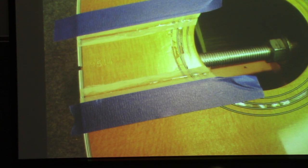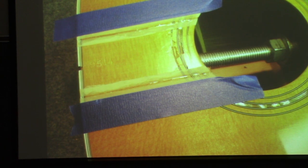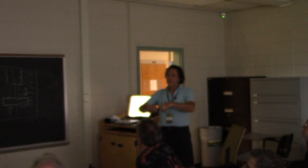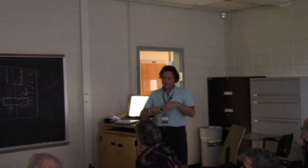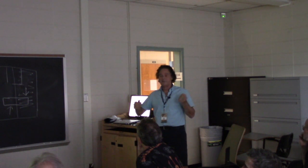How do you get the epoxy to go in? Okay. So that's actually the easy part. I mix up about 1.5 grams of epoxy. I've got a very delicate scale so that I can mix just small amounts. I usually mix about 1.25 grams resin to 0.25 grams hardener. I have it in a little 1-ounce cup, and I bring that over to my glue pot, which is about 150 degrees. I just hold the cup in the pot and stir it. If you do that in the pot, first off, the viscosity will turn to water. And secondly, you won't get any air bubbles. If you try mixing that cold, you'll get air bubbles, and I don't even think you're getting as good of a mix. You have to be careful. You can't leave it in there too long because it will kick off. But I'm talking 30 seconds of mixing.